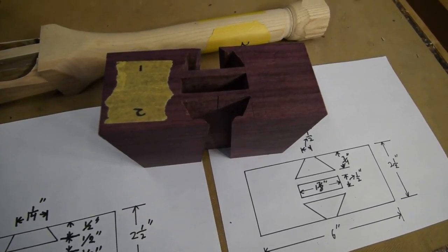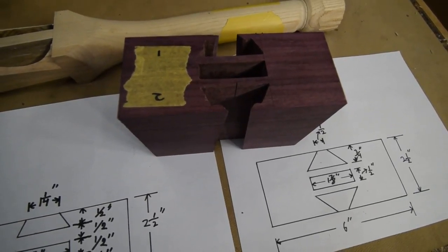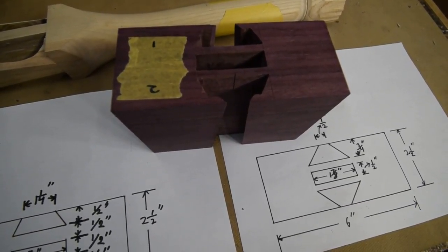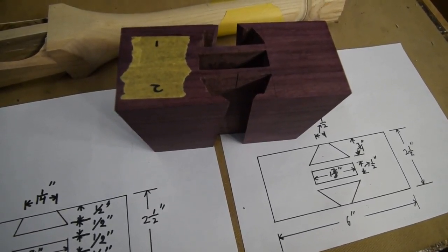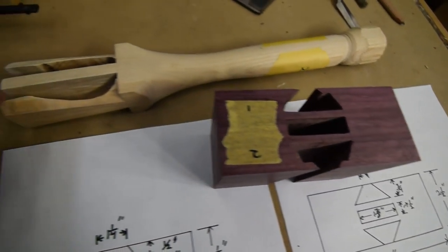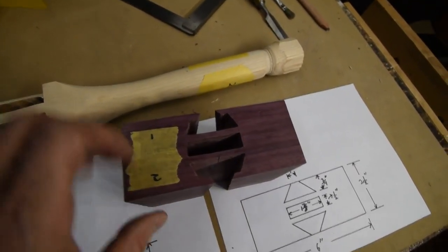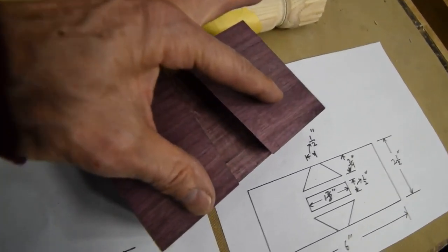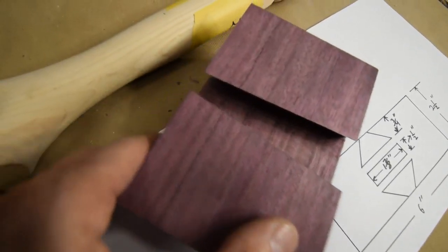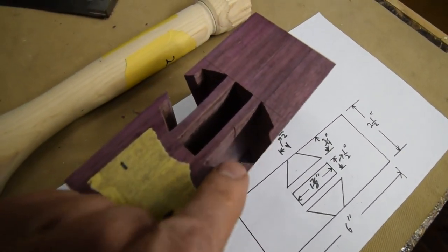We will see. I'm going to set up in a moment and you'll see when I go to drive it together if it breaks apart or not. To try and lube it, obviously I can't use grease. So what I'm going to do is put some thickened epoxy and hopefully that'll lube the little track I've made here enough for the dovetails to slide by. Because once they get in about 1/3 of the way, the head opens up enough, goes from narrow to wide, to where it fits. It's just that first 1/3 of the way that I've had to make these notch channels.